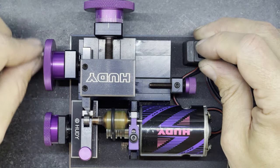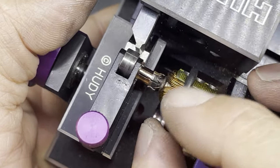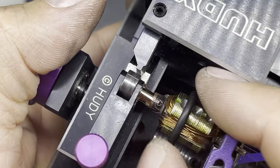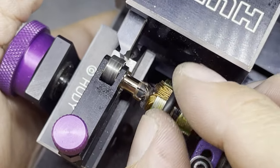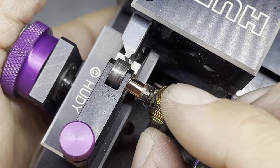One eternity later — you should now see that we're getting really close to finishing this comm off. That segment there is nearly done; that's probably the worst one and it's nearly done. I'm going to have to take it a little bit further to get rid of all the burnt parts of the commutator, so I do need a couple more cuts still. A few passes later, the comm is now cleaned up pretty well — you can see there's not too much burning around the edges of the slots now, and I've got rid of all the burning around the comm, so it will now run nice and true.